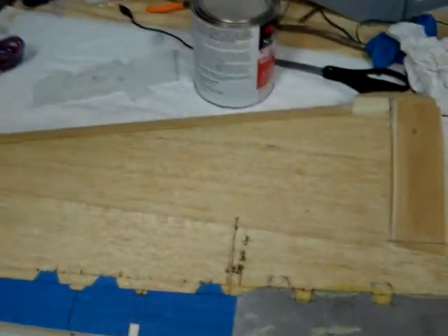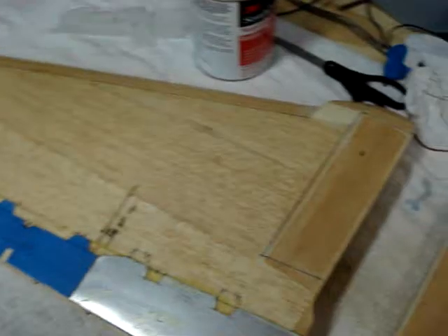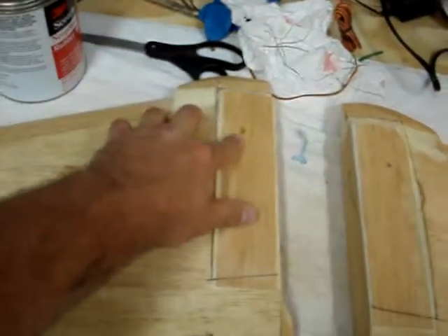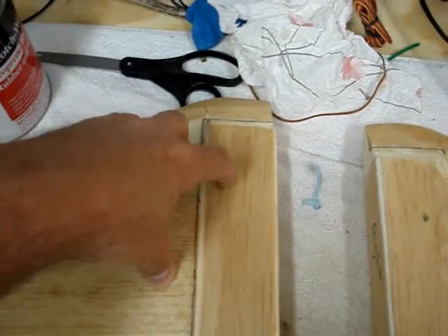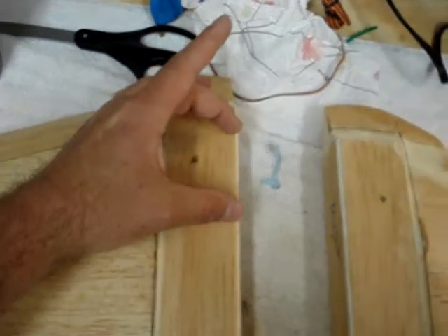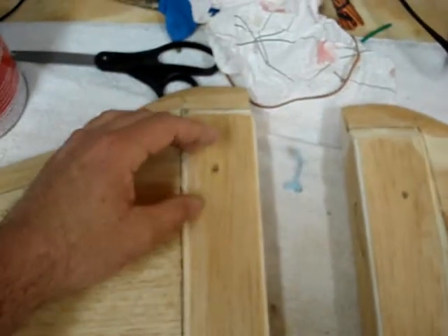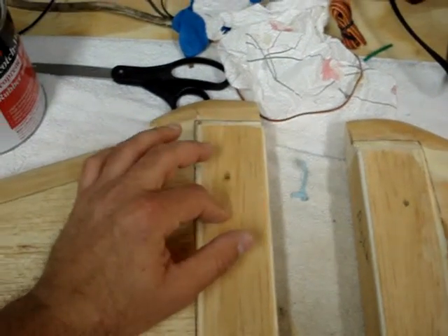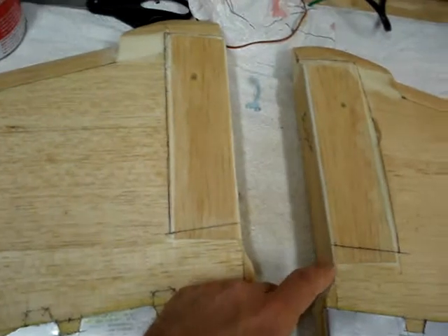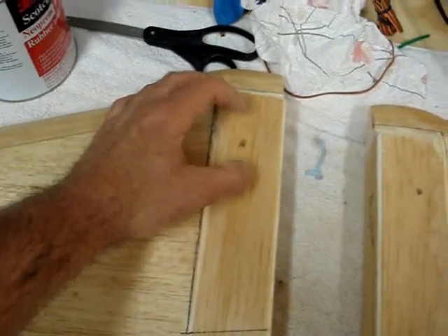So it's pretty high tech stuff for back when the full scale was originally designed. As far as the structure for the actual pivot point, the little dowel you see here is actually the pivot point — that'll get drilled out and will be part of the molds. I'm going to have a machined aluminum bearing holder that's going to get carbon fibered in between the wing panels. The bearings will be pressed fit in there, which is going to be two taper bearings, so it holds not only radial and thrust loads but also the incidence of the wing panel without having to have some sort of track system back here. So it'll be just like Bob's setup, just a little bit smaller. The bearings are only about seven-eighths of an inch for this airplane, compared to Bob's which I think are like two and a half inches or something.